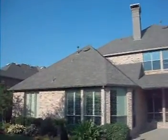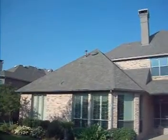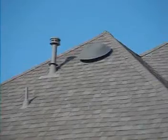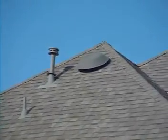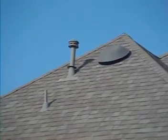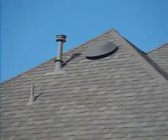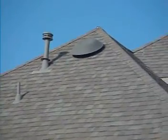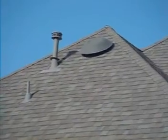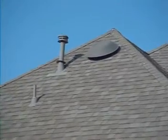One problem is up there. You can see that we have a flue, and it's adjacent to a roof vent. In this situation, the flue gases coming out of the flue can re-enter the attic through that vent. Once in the attic, they can get into the air handler and spread around the whole of the house. It's a safety issue. That flue needs to be extended at least another 2, maybe 3 feet, take it well clear of the roof and the vent.